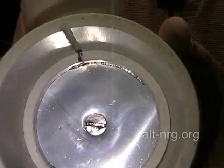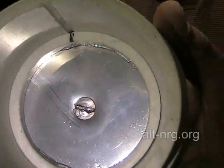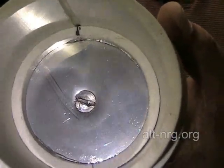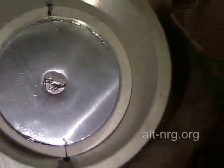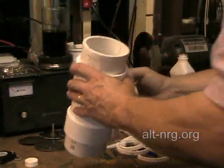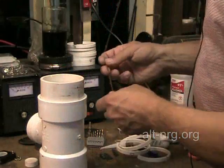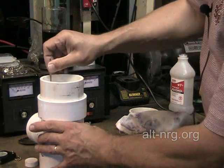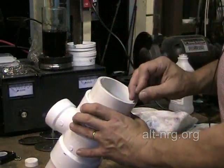The amount of glue that just got squeezed out when I assembled that C-ring was scraped from the inside diameter of the three-inch tube — it was just leftover adhesive from when I applied it before putting the plate in. So it was just the right amount of glue for both sides. The object here is not to use so much glue that you're going to clog up the passage needed for the gas to flow over the top and the electrolyte underneath.